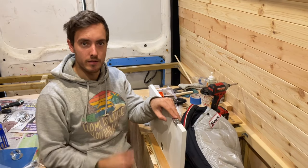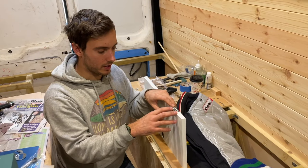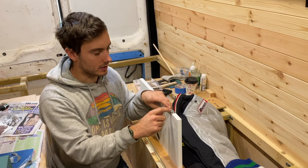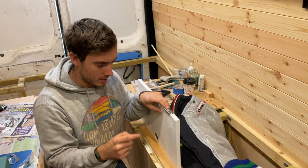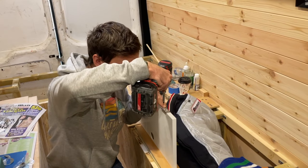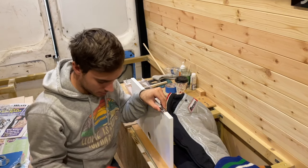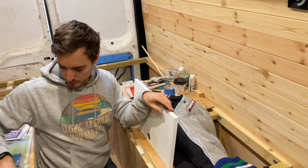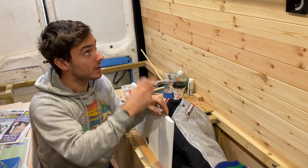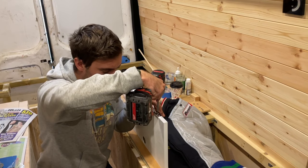We'll continue that step over the other side. Once that's pre-drilled and you've got it facing down, you want to now rotate that so the lip is facing up, and that is going to meet with the top of our face frame. We've got the holes pre-drilled, we've got the small screws, and we're just going to go through those holes and that is going to keep the hinge in place. You want to make sure that the heads on these aren't too big — if they are they'll go way above the hinge and give you problems closing the door. In this case we're using three millimetre screws.